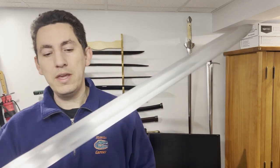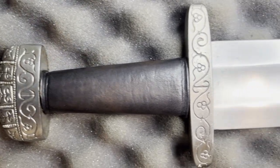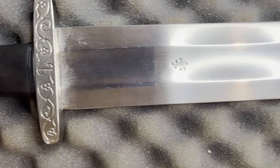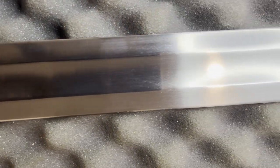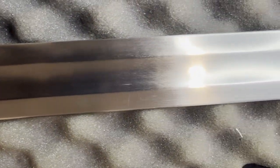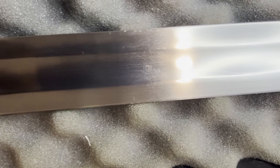This is a very old sword, but the finish on it still is pretty consistent all the way down where it hasn't been left uncared. Something interesting — consistent with what I've seen with other Albions — its final edge is not apexed. So there's always this big debate as to how sharp a production sword actually needs to be. We'll show the comparison between the two in a second.